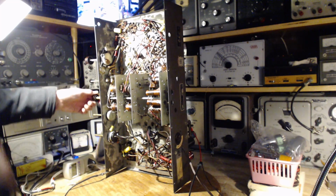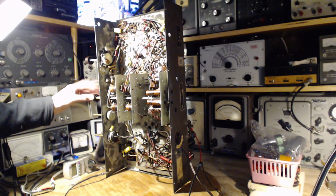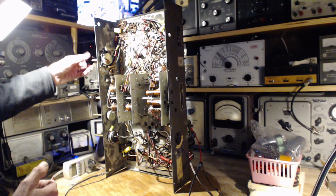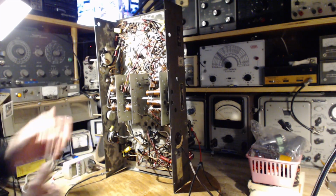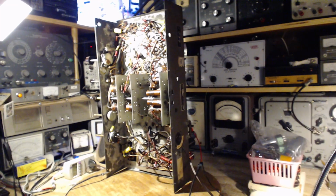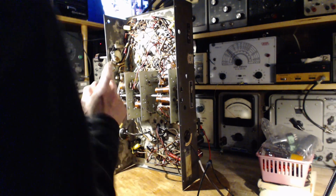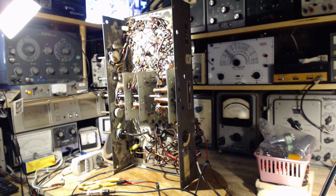Top band, it just goes silent again. Guess the idea there is there's no local oscillator, there's no conversion. Ooh, what's all that? There's no conversion to the IF frequency, so there's nothing to come out except what I guess we could call IF frequency noise. Well, what did I say I was just going to do? Set up to be more aware of what's going on with the local oscillator. Let me do that. Okay, it started making the sound again.